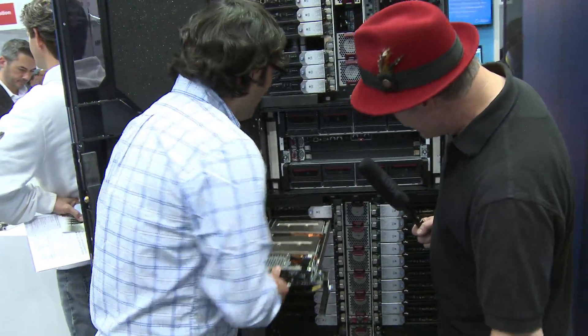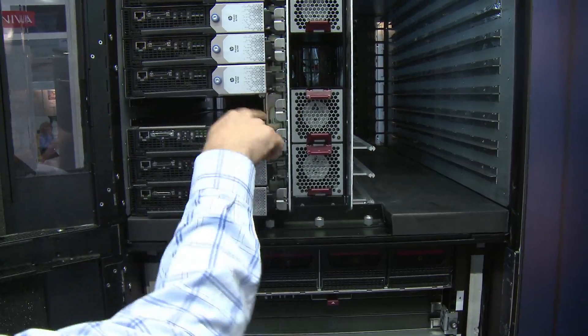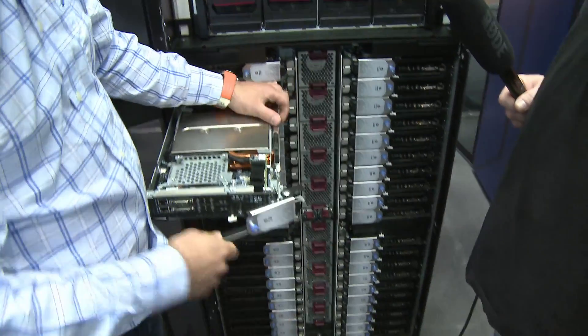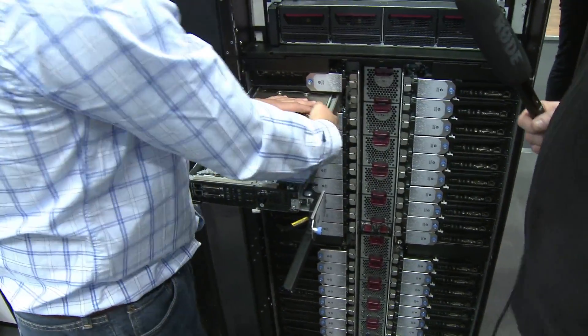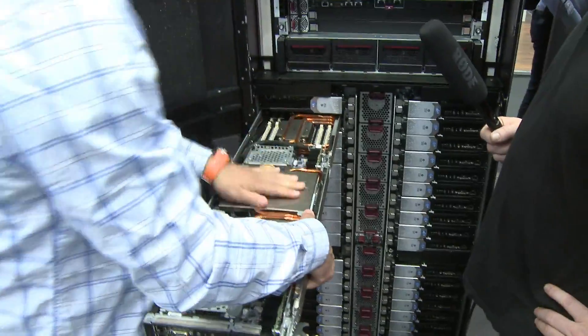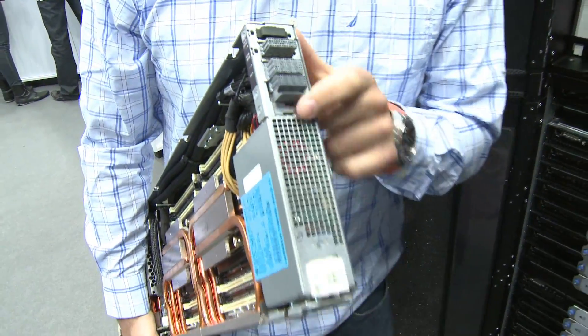So how do you do it? We do it through this system here. That moves in the thermal bus bar and makes a mechanical connection to the tray — that's where we extract the heat. When you engage that clamping system, the thermal bus bar makes a very strong — think a thousand pounds of force — mechanical connection, and the water flows in the thermal bus bar inside the rack. It never actually goes into the node. We think that's a huge value proposition, because everybody out here at ISC — there's probably 13 companies with a different approach on liquid cooling — and they all have those dripless connectors. We joke around saying: do they call them dripless because they drip none, or because they drip less? Once you pull the tray out, you can see there is no water connection here — that's just electronics and electrical.